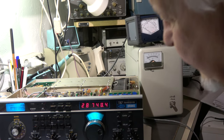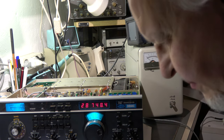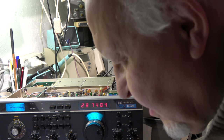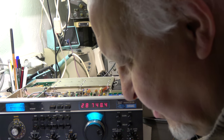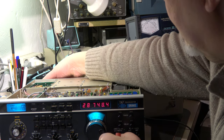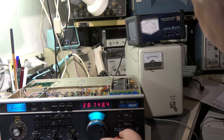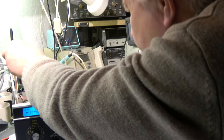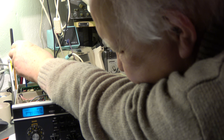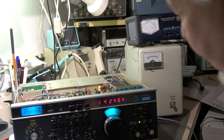50 Watt, 60 Watt. It's more — as long as the transistors get cooler, the output power increases. The reflected power can be set with the antenna disconnected, but I have to reduce the output power. 14 MHz, now the reflected power. Forward and the reflected power is now identical. That's okay.